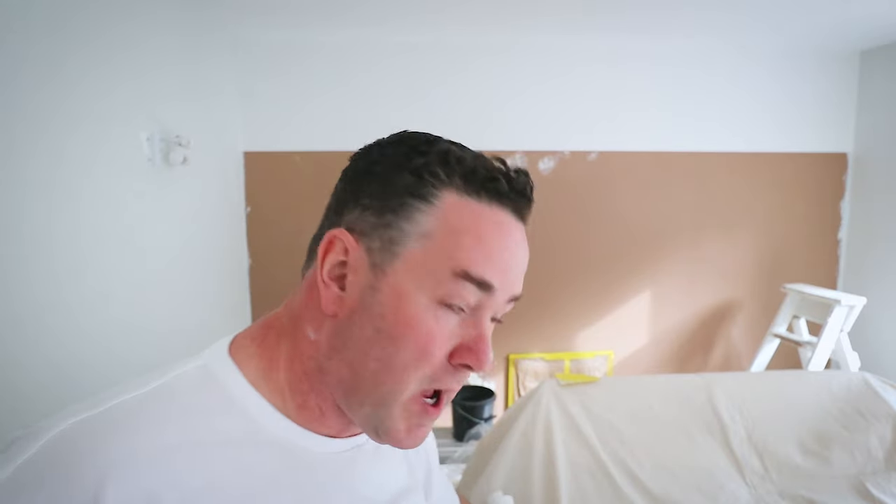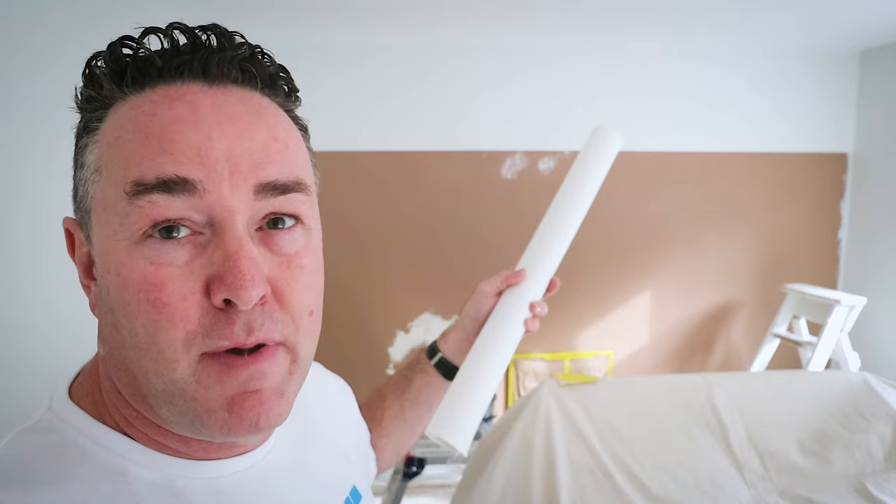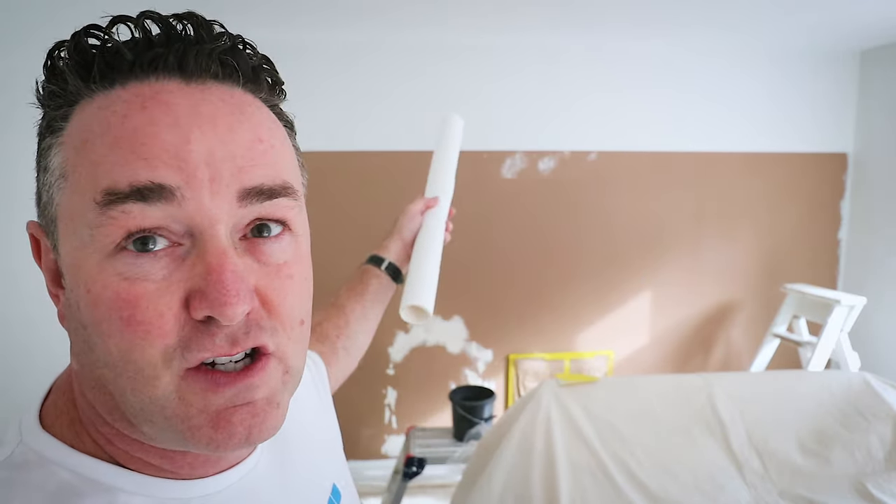Across the top it actually hung to it, so that was quite easy. The awkwardness is holding with one hand - if you've got small hands you're not going to hold a big roll of wallpaper easily, and these are doubles. Sometimes it's a two-person job. On bigger expanses that might be easier, but I managed it. I would say hanging top to bottom would be easier if you're on your own on a bigger area.